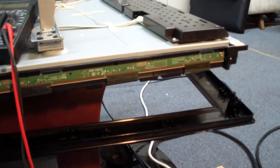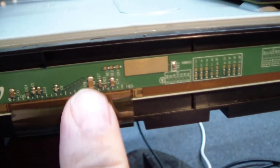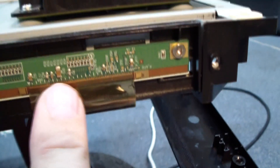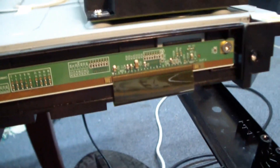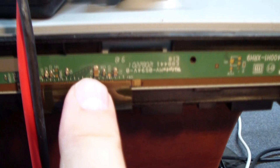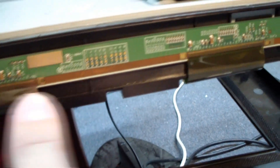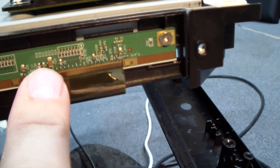Here's what I've found. There are three big capacitors — a big one right there, a big one right here, and a big one right there. Measuring across them, there's a short — I'm getting around 4.7 ohms. On this end it settles to 4.7 pretty quickly. This one also goes to 4.7 but takes a little bit longer to settle. And this one settles to about 4.8.